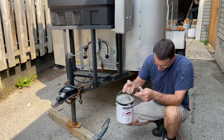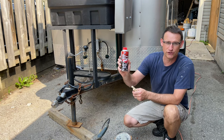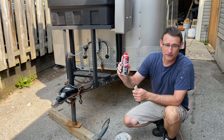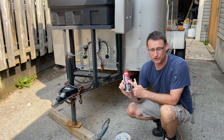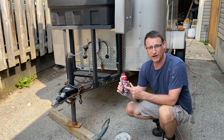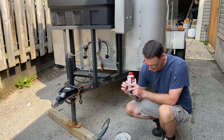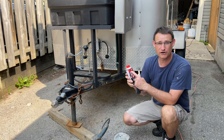So I'm going to add some universal urethane hardener. This is the key to making this work, and you can do it with anything — if you're going to paint your furniture outside, trailer frames, bike frames, whatever — you can use this oil-based paint with the universal hardener.